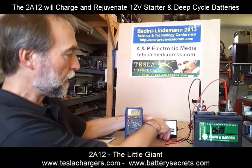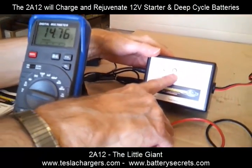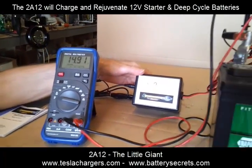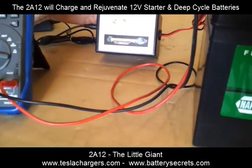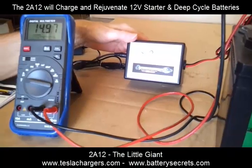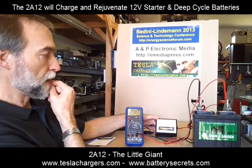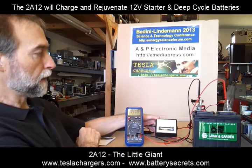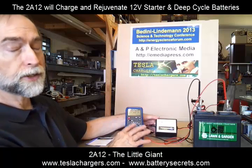We're at about 14.5, and now we're at 14.6. We can see the green light is starting to flash along with the red, which means the voltage is above about 14.6 — now we're above 15 here, and you can see these are almost flashing equally. As we continue to push the voltage a little higher, you can see that with the red and green lights flashing almost evenly, the voltage in the battery is at about 15 volts. It can push batteries four or five times this size to these voltages without any problem — it just takes a little longer, because again, it is just a 2 amp charger.